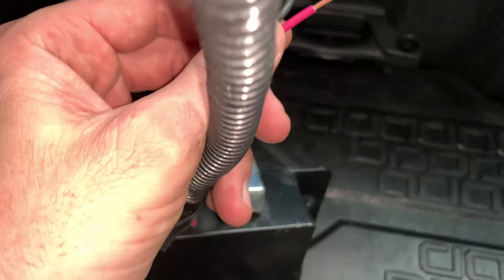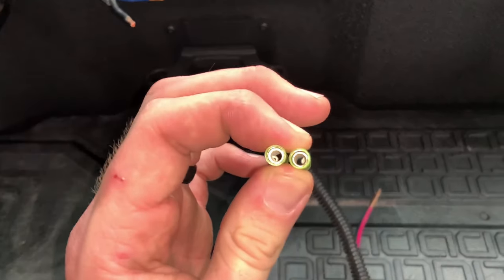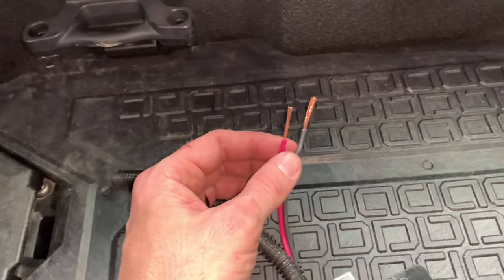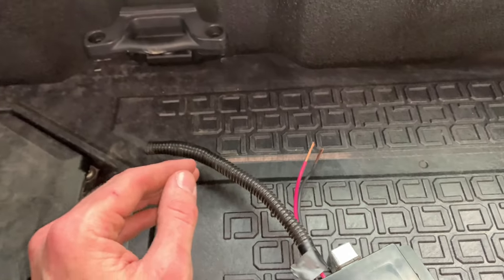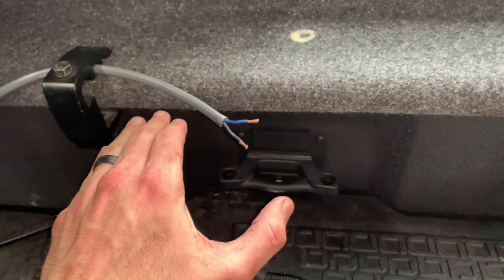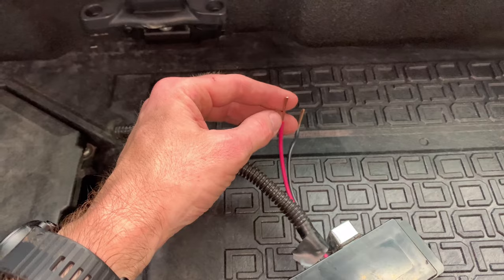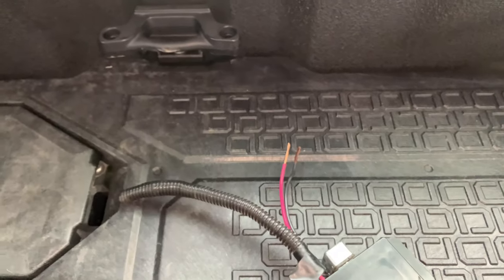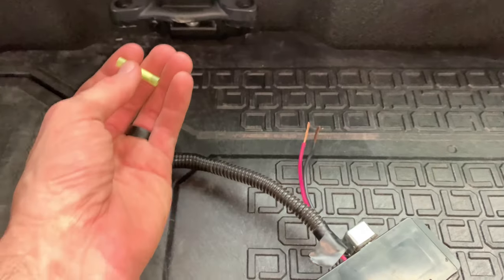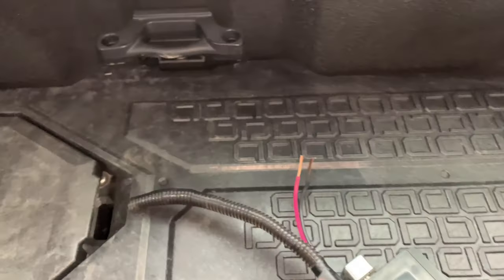Now as you can see, this wire is quite a bit smaller than this wire, and it's okay. This is actually too big of a butt splice for it, but that's why I've skinned this back longer — I'm just going to fold this in half and stick it in there. It ain't like I'm trying to hoist up Rapunzel or anything. It's literally going to be screwed here and not moved, there'll be no pressure on it. If you've got two mismatched wires, you can fold it in half. You would not want to do it if you were pulling load on it, but under these circumstances it's fine. It's Colt's way.